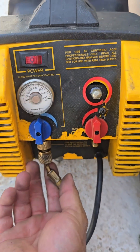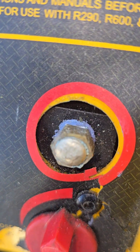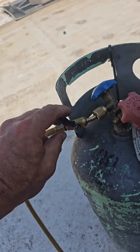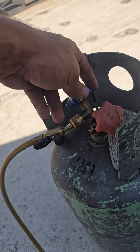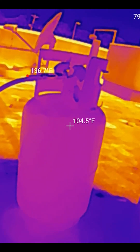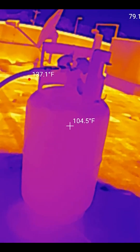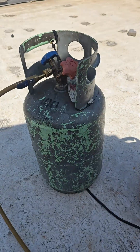If you're asking what happened to its other eyeball, I got into it with a vacuum pump. You put a dab of solder over it to make it stop leaking. I'm going to hook onto our recovery tank — we'll open that back up, let some gas go into it. Right here is our recovery jug. I've not yet turned on the recovery machine; I was just curious what it's going to look like beforehand. So now we're going to turn on the machine and start pumping refrigerant into that.